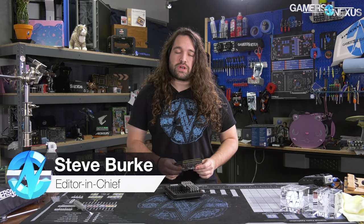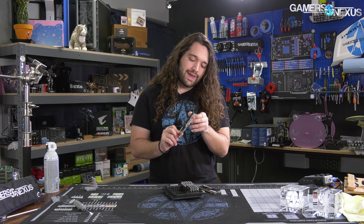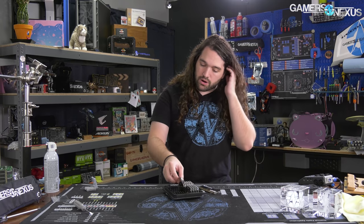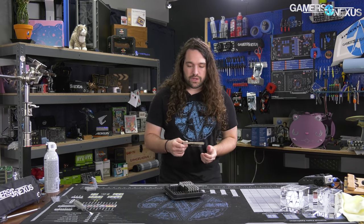Hey everyone, just a quick video. We're going to use a trick that Joe from Bearded Hardware taught me and remove the heat spreaders from some memory. Doing this by hand is always a little bit worrying because of the force required — it's a thermal adhesive they use, not just thermal pads. So once you start pulling hard enough, the risk is that you end up ripping a memory module or small capacitor off. Liquid nitrogen in a small container like this works really well.